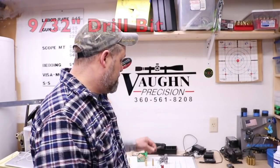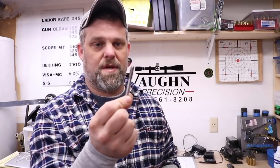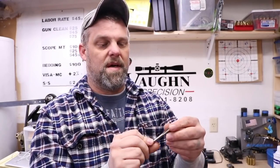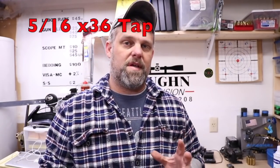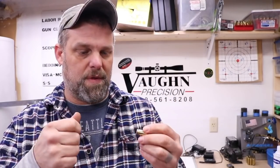How do you make one of these? It's actually pretty simple. You fire form your case and take a 9/32 drill bit and the tap - I'll leave a link below - you can get these from Amazon for under ten bucks. They're cheap. It's a 5/16 by 36 tap. If you're really careful you could make one of these with a drill bit and a vise, just making sure things are straight. If you have a lathe or a mini lathe that would be a lot better. Or if you really want to, you can just send me a case and I'll make you one as long as I have the body die for the caliber you're shooting.